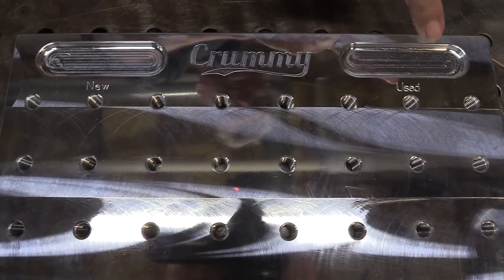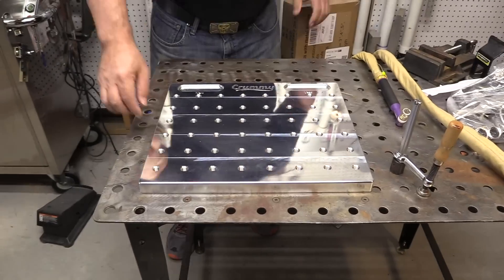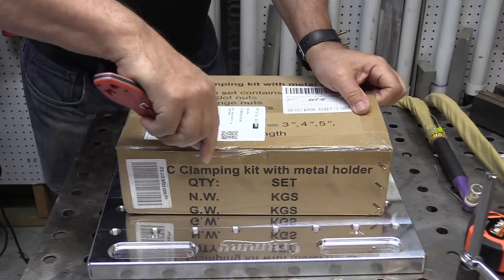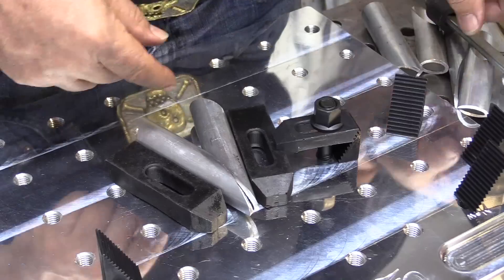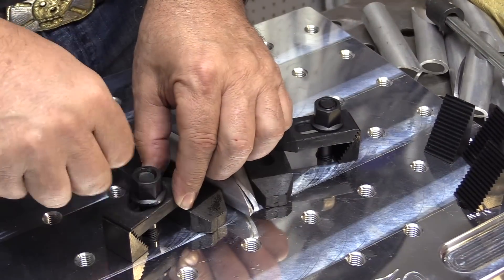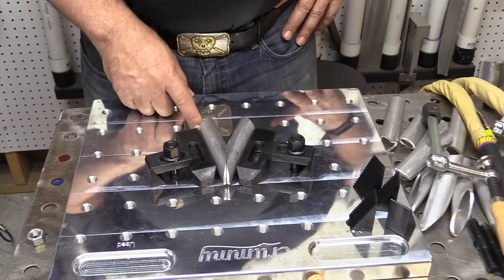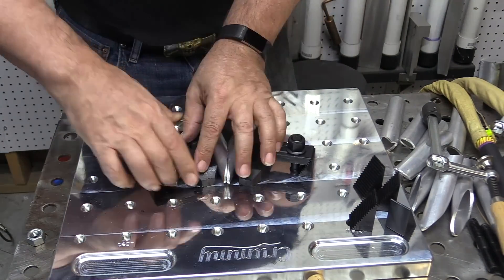For this video I ordered an aluminum tubing laser-cut star — I thought that would be a really good example of how useful this fixture plate can be. I'll fixture up the small pieces, tack everything together, and use the fixture and hold-down kit I got from Amazon to show how I would do something like that. This is just one way of doing things, but if you've got a little short run of parts, it sure saves time.